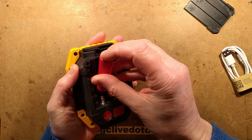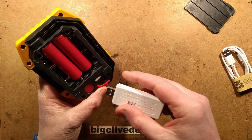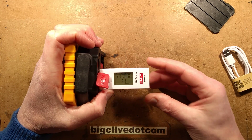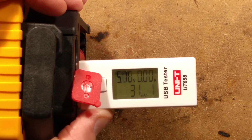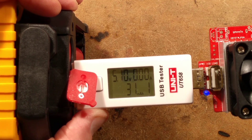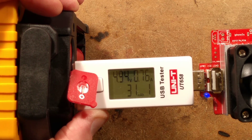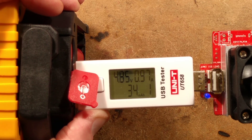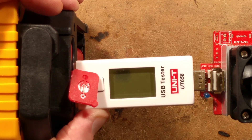Let's get the cover off and stick the cells in. We'll zoom down - 5.1 volts. Let's get the load tester in, set it right down low. At 0.6A the voltage is drooping a little; at 0.8A it's 4.89V, not too bad. At one amp it starts dropping off and then cuts out. So this is able to put out one amp - that's useful enough.